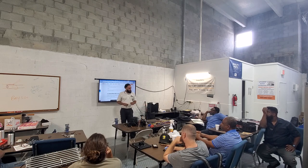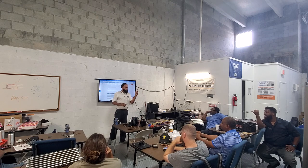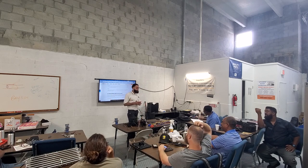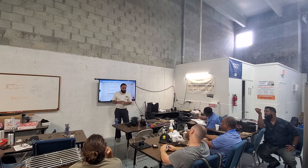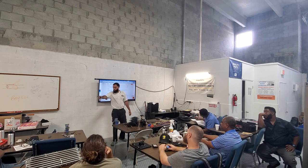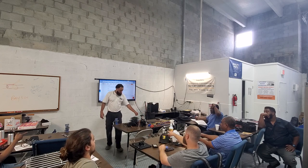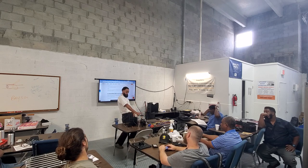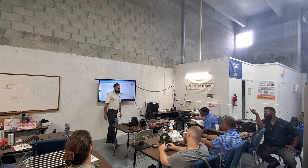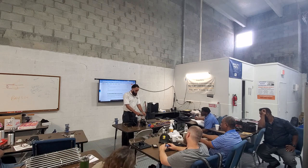We got our new filter dryer on. How do we know what side to put it on? There's no arrow on this one, made in China. The smaller end goes toward the capillary tube. The side that has the valve on it, what side does that go to, Gene? Who's got a filter dryer? Right here, yeah. This one here is an independent one. Where does this one go? This goes to the capillary?